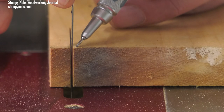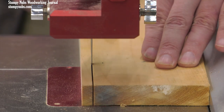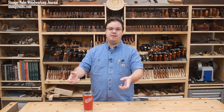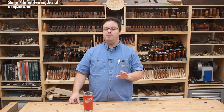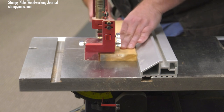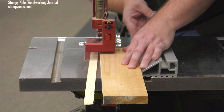Note if the back of the blade is rubbing on one side of the kerf or the other. From the perspective of standing behind the saw, if it's rubbing on the right side of the kerf, the table must be rotated counterclockwise. If the blade is rubbing on the left side of the kerf, the table must be rotated clockwise. Make small adjustments and a few test cuts until the back of the blade remains centered in the kerf all the way through the cut. Some tables might come out of adjustment when you tilt them for bevel cuts or if you move the saw by grabbing the table. So check it once in a while and make corrections as needed. Adjusting the table like this is better than adjusting the fence to compensate for drift because it actually solves the problem rather than covering it up, and it aligns both the fence and the miter slot to the blade at the same time.